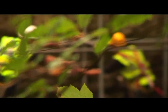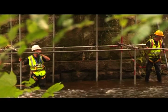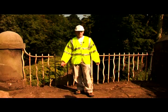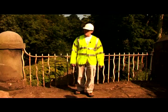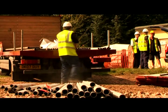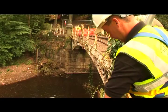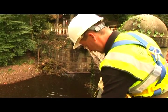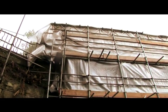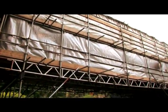Down behind me in the river we've got a couple of men fitting the scaffolding. They're actually up to the waist in the river — I didn't realise they'd have to go in the water but they do. Over the next day or two the scaffolding will be going straight over the bridge, then there'll be an encapsulation and they'll start the work generally out of sight of the public. The scaffold formed a full encapsulation around the bridge, protecting the environment and wildlife from the poisonous lead-based paint that was to be blasted from the original iron structure. Contained within the scaffold using special grit and a powerful hose, the stripping of the bridge began.